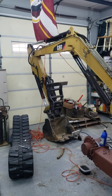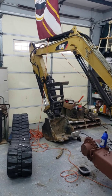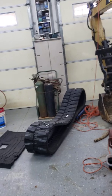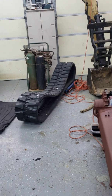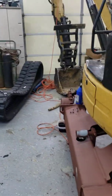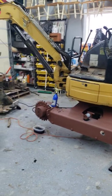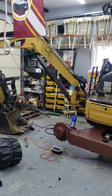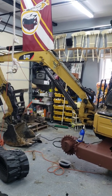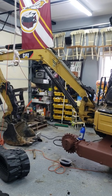So the main tip is: use JB Weld on those bushings to set your pin alignment, then weld them in for a permanent fix. For track problems, I used a dolly on one end of the track to pull the 350-pound track over. I'm waiting on a spring for the undercarriage assembly, and then I'm getting ready to get this machine out there to finish that road — once it stops being snowy and wet.